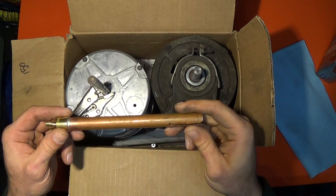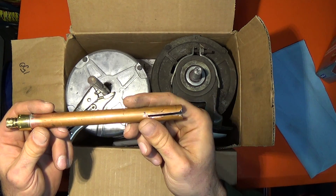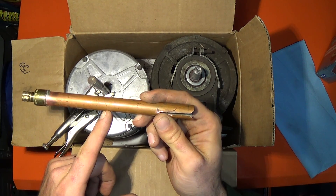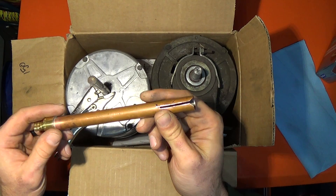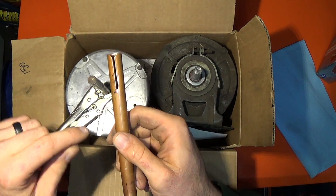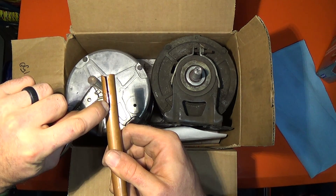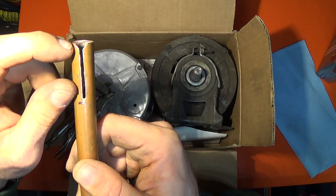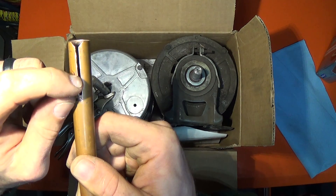What I did was I made up something really simple that just sands the shaft. This is just half-inch hard copper, so that's 5/8 OD — you want hard copper, just regular plumbing half-inch copper. You cut a groove in it like this with a grinder, and then I sort of tapered off these edges so you can get the sandpaper in there.